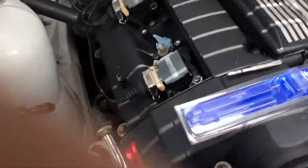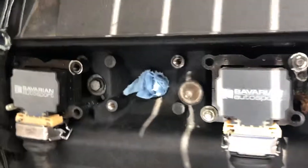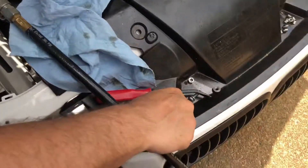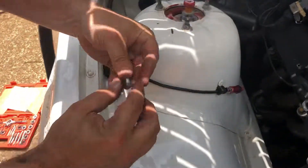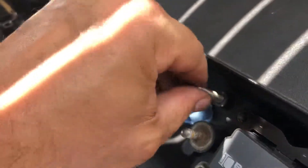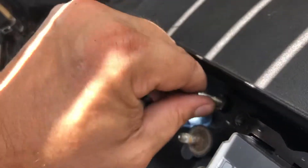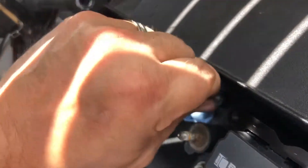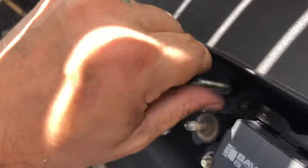Go ahead and take a picture right in there inside the hole — you can see that the little helicoil is now in there. I could take a normal M6 bolt, and you can see that once it grabs, it grabs. It's nice and snug already — I had these kind of coming right out, and there you go.